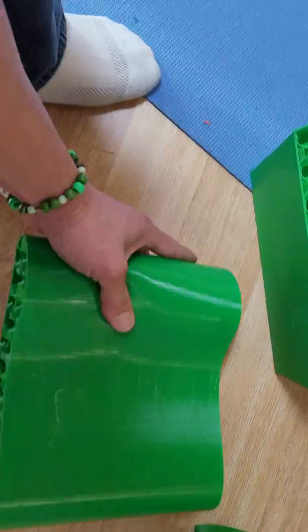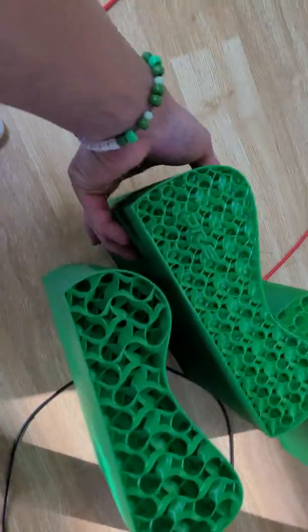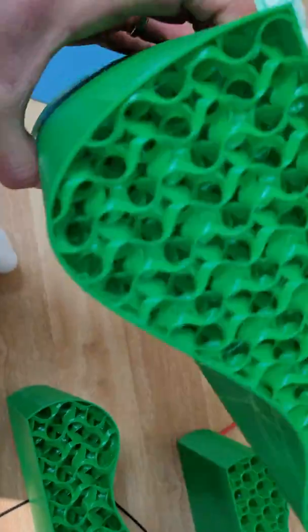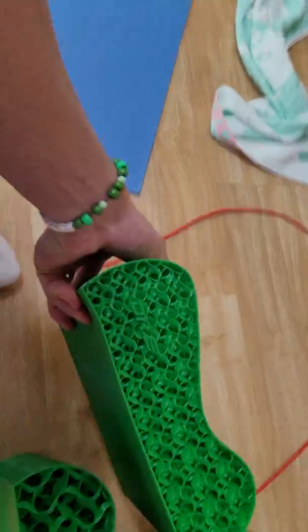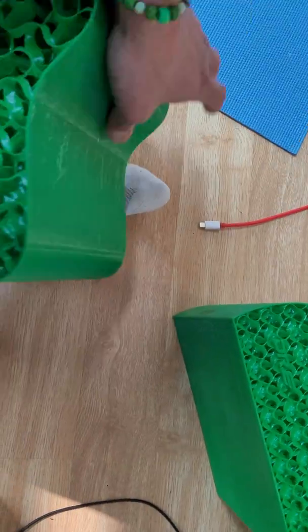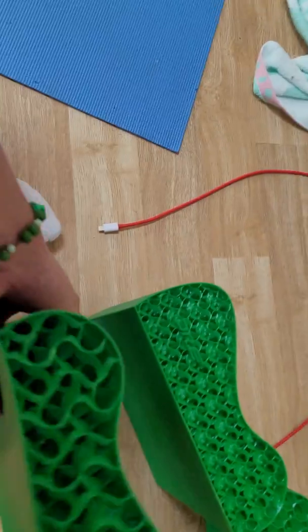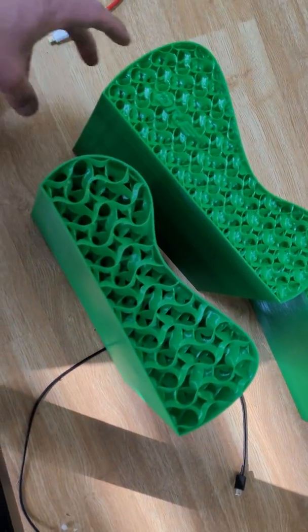For soft material, you want very equal pressure in all directions. I'm testing out a bunch of new pillows — they actually work pretty good at 5% infill, though that might be a little too much. 3% might be a little too soft, so maybe 4% is the sweet spot. Really trying to dial down the percentages.